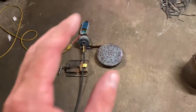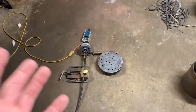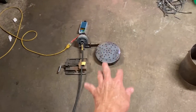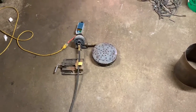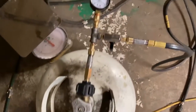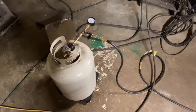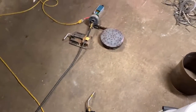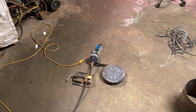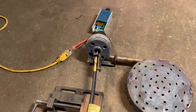Now we've got to increase the power of this boiler from 36–40 kilowatts up to — I'm trying to hit 250 kilowatts, bare minimum. I don't think we can do it with this spud though, so we've weighed the tank. I'm just using a valve with no regulator; when you're running this kind of flow rate, regulators are out of the question anyway — you eventually lose bottle pressure, so you might as well just have a valve. Let's check this out — this is a plate burner that's been supercharged.